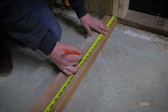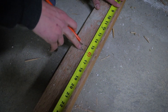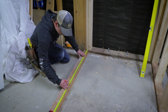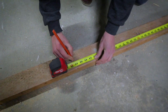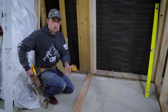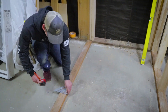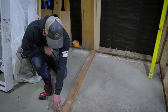So 15 and a quarter, and that will be your center of your stud. You always mark where the side of the stud goes on the line, then move down to 32 and go back 3 quarters of an inch. Make that line and an X, and so on down — make that line and an X. Once you get your whole wall laid out, you'll take your speed square, go onto that line, mark all your marks, and now you know exactly where your stud goes.